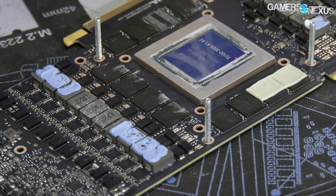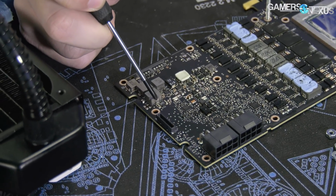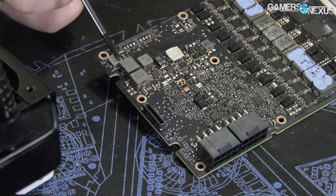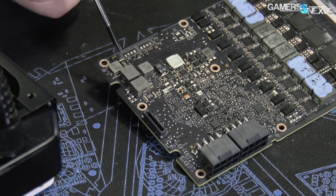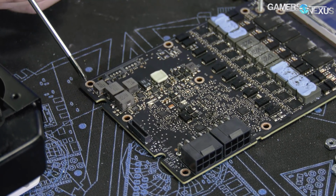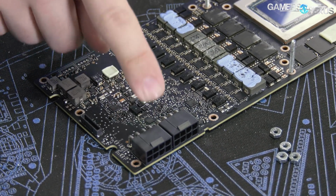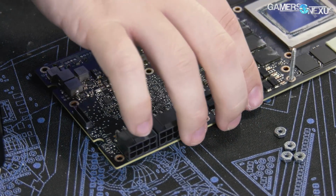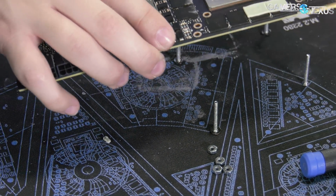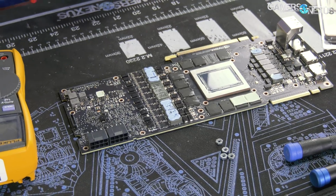The shunts, though, just for reference, we have one over here on the PCB, that 5 milliohm shunt. So that's one of them. And then we have another shunt right there, 5 milliohm shunt. And on the backside, in this area on the backside, there's a third one. And those will correspond to the connectors. Actually, I should check. I'll just check right now and see where specifically does each resistor correspond with the power connectors. We're just going to do a resistance check.